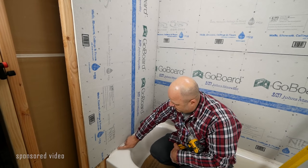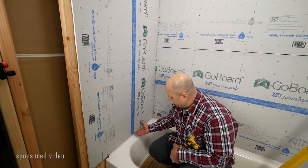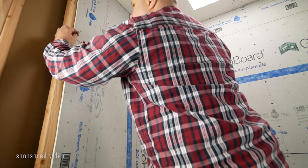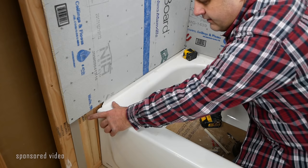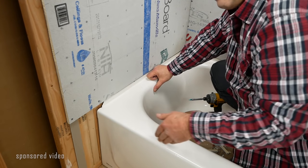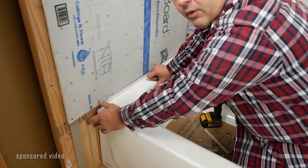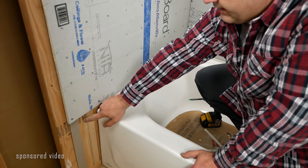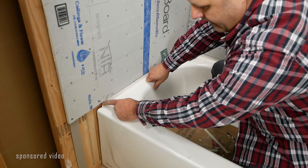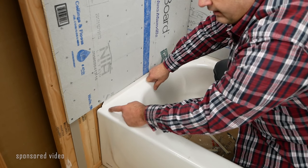As I mentioned before, you always want to make sure that the board is in front of the tub flange, and it's okay if it hangs over too far. We've got the two legs on each side of the tub. I like to have the backer board on each leg because if any water gets in, whatever the low side of the tub is, water that drips on the outside of the glass can run down. If it's just drywall there, it's going to ruin it over time. So I always like to have the backer board go down on each end of the leg.